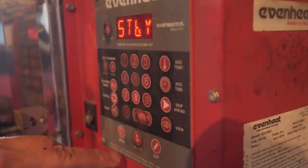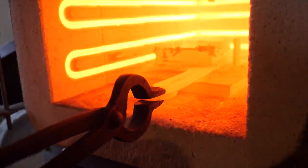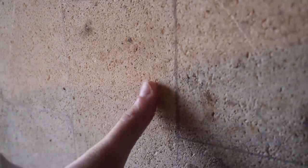I'm also going to cook this a little higher at 1950 degrees this time, so when it gets to 1800 degrees we should be liquid because bronze should liquefy somewhere in the 1750 range. So I'm going to start jiggling it and giving it some go, and when it gets to 1900 degrees I'm going to do some more shaking.